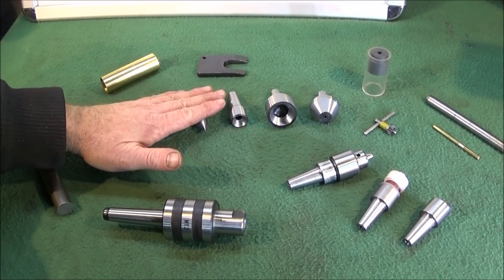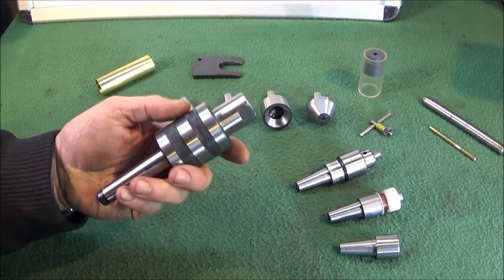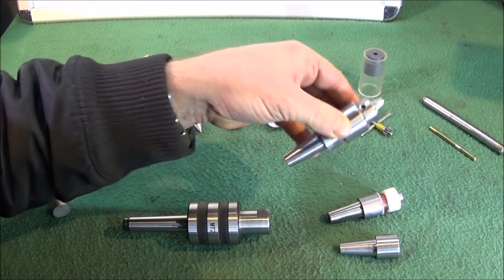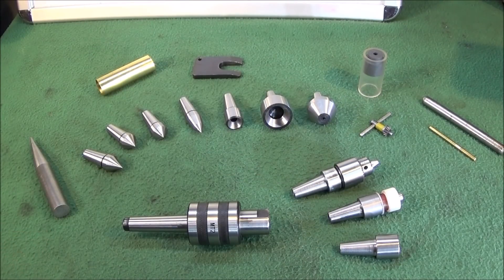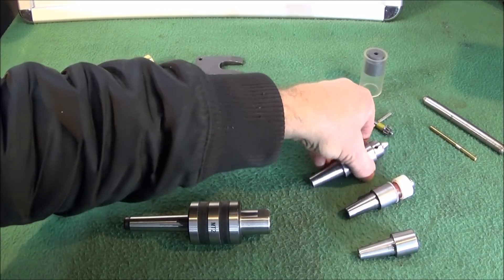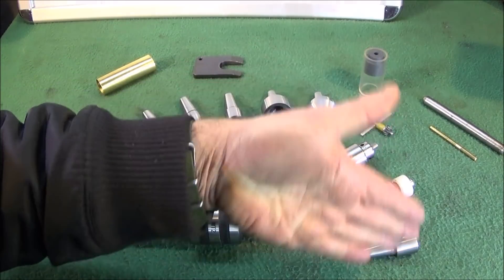The kit is really excellent as it is with the seven tips that come with it. But the real beauty of this tool system is that you can make up your own tapered ends to suit whatever tooling you want for whatever work holding situation arises. I quickly and easily made up three here. The hardest part was getting the angle right — I had a few attempts, and once I got it dead right I left the machine set and machined all three.